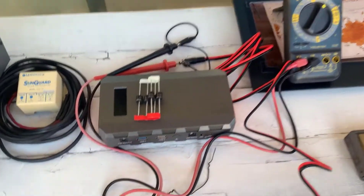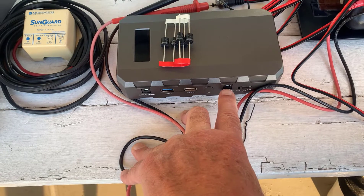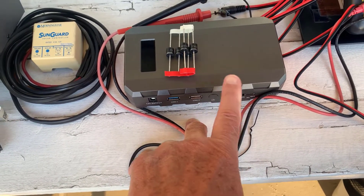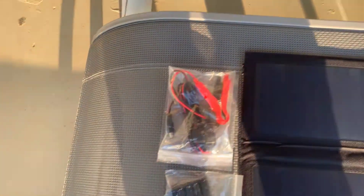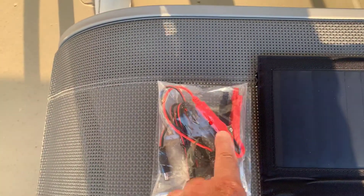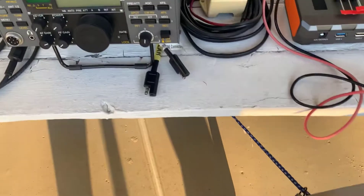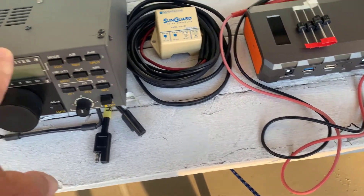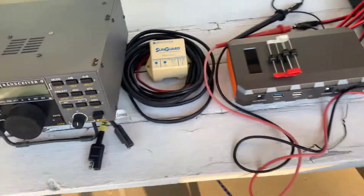The other thing I can do with it is — this is an 80 watt lithium power pack, and it takes 15 volts, I think it can take up to 16 volts in to charge it. So what I'm going to do is use some steering diodes, put them on the 18 volts, so I can use it to charge that. Also, the panel comes with a series of connectors. I can use this Morningstar regulator directly with the 18 volts to charge a car battery. I can also operate my K2 with the linear regulator I have — I can operate the K2 from the 18 volts.